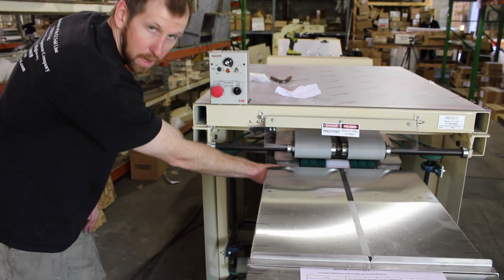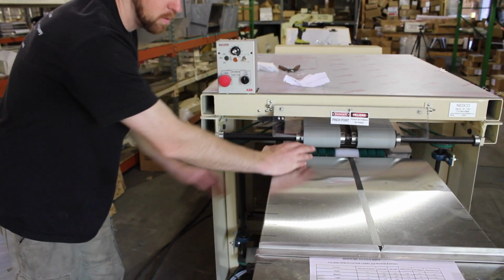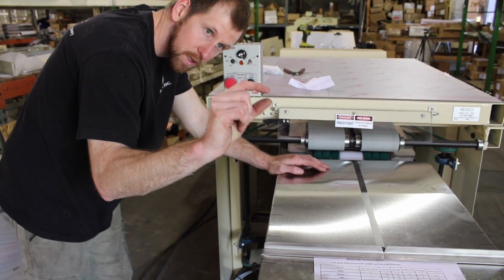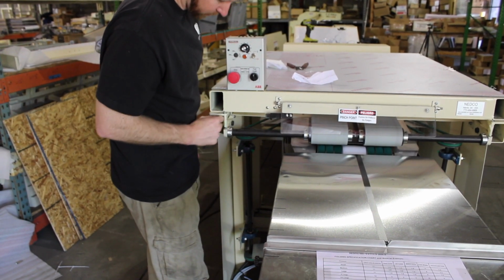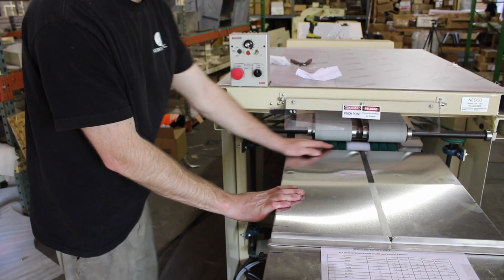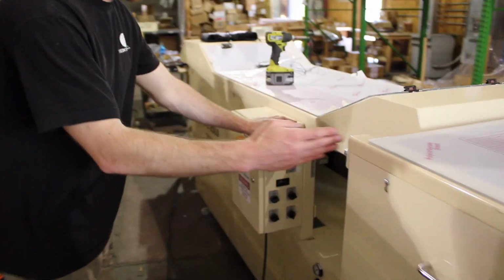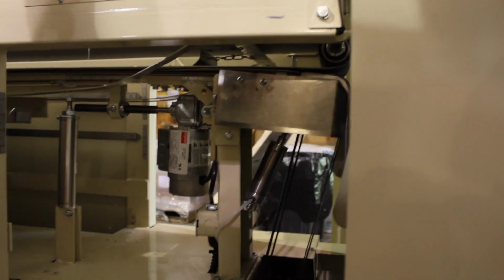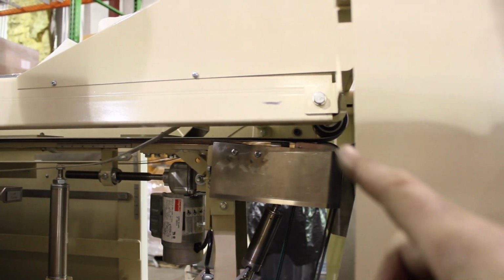These bottom rollers move up and down, and the reason for that is you have t-shirts and then you have large hoodies. You can't run a hoodie when it's this tight, because it's going to push this up. You have springs that are going to make it come back down. So you have a pinch point here, and then you have another one, if you have a long sleeve, from the long sleeve to the 2000, which is in there. Ryan's kind of showing you, but you're going to figure out where that is.